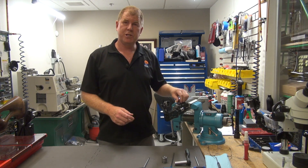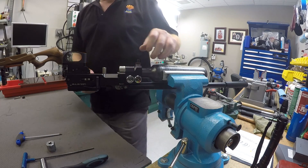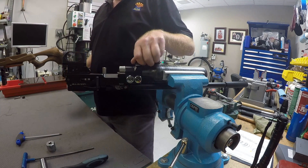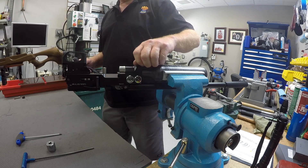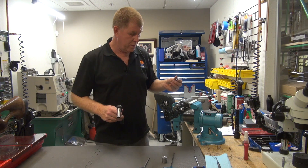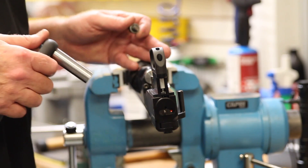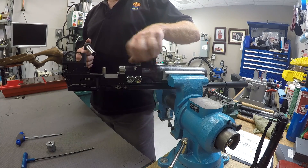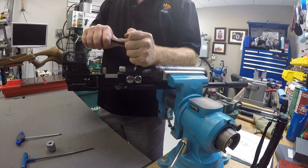It's been a few minutes and the air pressure is now out of the system. You can look at the gauges and see that there's no air pressure. I went ahead and unscrewed the fill valve completely and there was a little air left in it, so just be careful. You don't want to start doing work with any kind of pressure in the chamber. Once you know that the gun is completely depressurized, you can go ahead and put the fill valve back into position and tighten it back up.